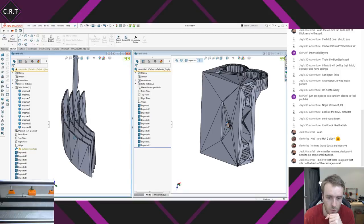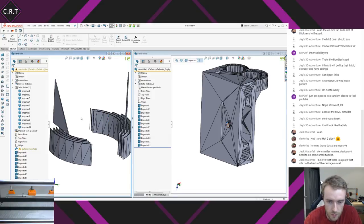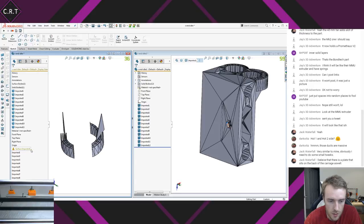This mess. So this is what I talked about before about having inside perimeters. So they've put these inside the part so that using slicer, they know that it will manipulate it in such a way to put perimeters on the inside of the part instead of infill, which improves the strength a bit, but not in a particularly meaningful way. And also here too, they've got this weird thing where it also adds inside perimeters. The question is, where's that hidden?